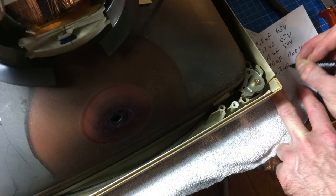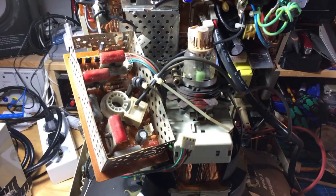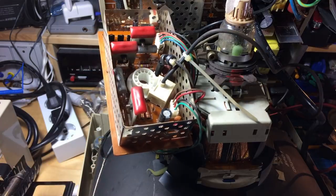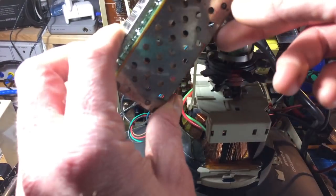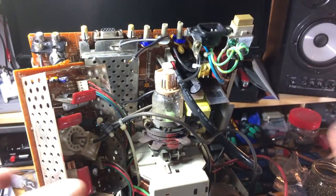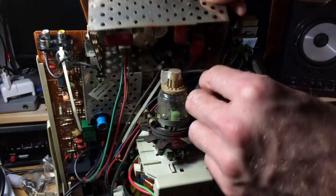I'm just going to reassemble this, clean it off a bit, and do a test run. There's another capacitor — 22µF at 50V — I would have that, but I won't disassemble everything until I have the other missing one, because I'd have to desolder the shielding again. So I'll leave it for now and reassemble. I hope I can do that without breaking anything, which isn't a trivial task.